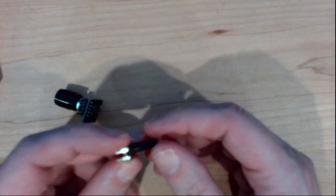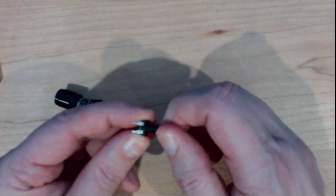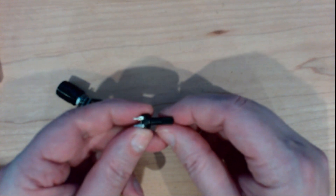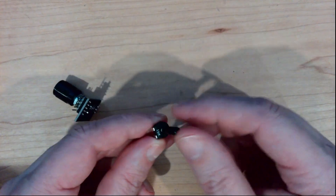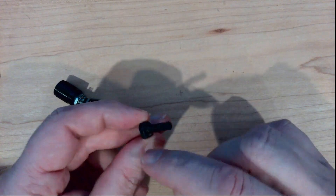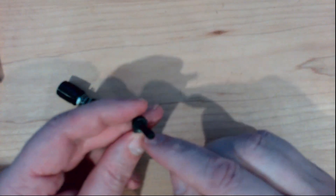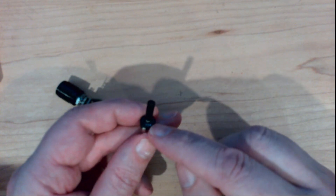Another type is the potentiometer. This one is a rotary knob, and as I turn it, it'll go all the way to one direction and stop. You can see this one says it's 10K. So what I do is I can rotate it all the way to one direction and it basically has no resistance through it. And then, as I turn it all the way to the other direction, it's going to go to 10K ohm resistance through it.